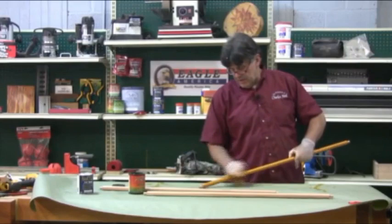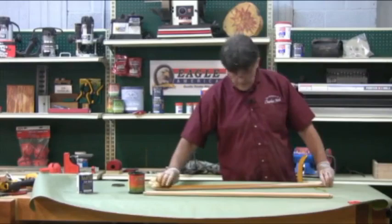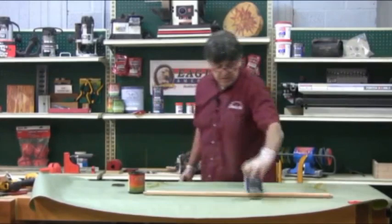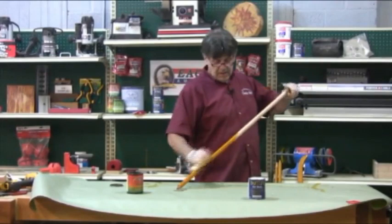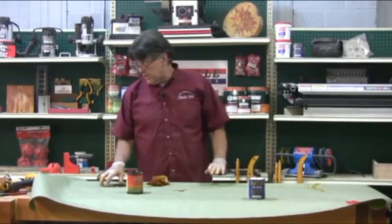Now I think in my finishing, I'm probably going to go with some gel stains once I've got a good uniform base. And I'm probably going to top them off just with a hand wipe gel. A good gel that's going to hang with me and do the job. I'll just use a clear top coat, or maybe, I'm not sure yet. But make the cherry natural cherry, I'm going to make the poplar one walnut.